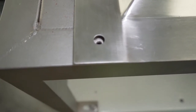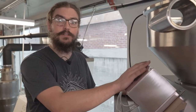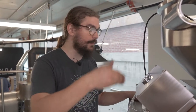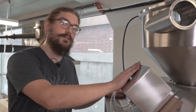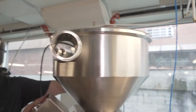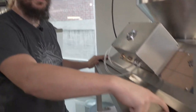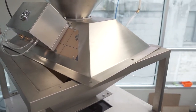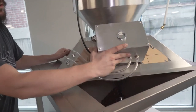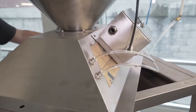You can line it up with the mounting holes and the screws and it's in position. Now that we have the equipment up on top of the machine, we're going to orient this control box here. This is the butterfly actuation valve control area. There's a solenoid in there that tells the butterfly valve when to be pressurized and drop the coffee. We want this to be generally on the back of the machine, but more importantly close to your airline. So what I'm just going to do is rotate this around to get the orientation correct. Just make sure that none of these tips go inside the chamber area — it is possible for it to fall in. It could maybe scratch the equipment, but it's just a little bit of a pain to get out. So if you just make sure that none of the tips are going inside of that chamber area, you're going to be able to ensure that it doesn't fall inside when you're rotating it around.